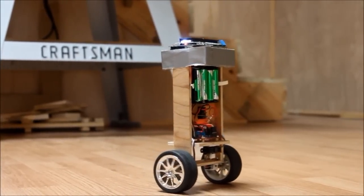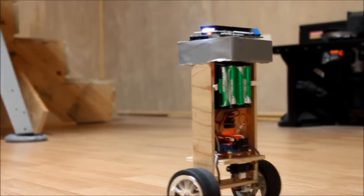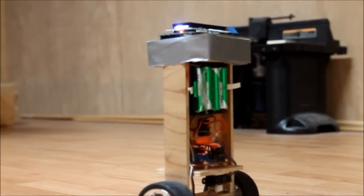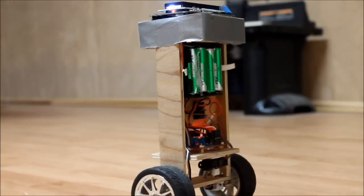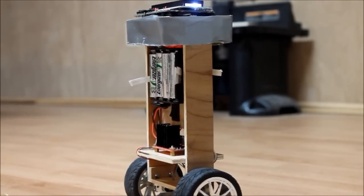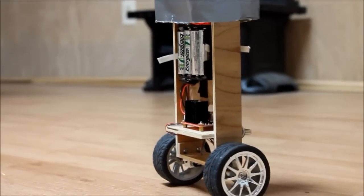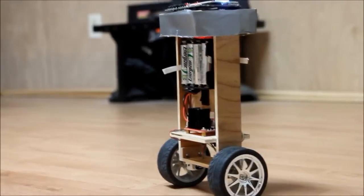Additionally, this average gets added to what I think of as an all-time running error, which also contributes to the balance point setting. The idea is that if the car hasn't moved at all, the sum in this bucket would be zero. If it's moved either forward or backward, this error bucket would have a non-zero value fairly proportional to the net distance traveled. This won't have the accuracy of digital wheel encoders, but it doesn't require any additional hardware — which, particularly for the N20 wheels, would be hard to implement.